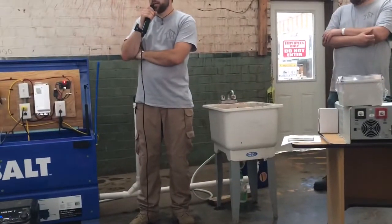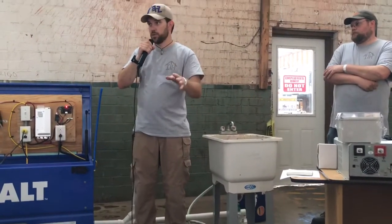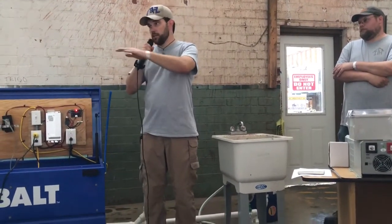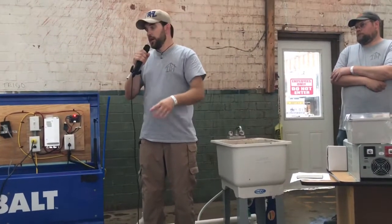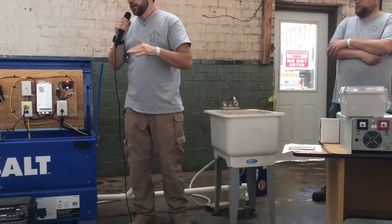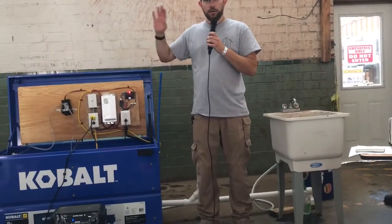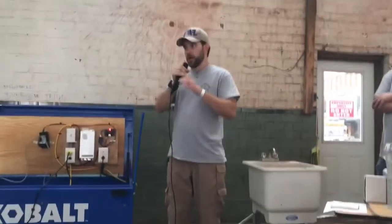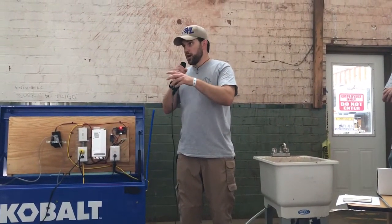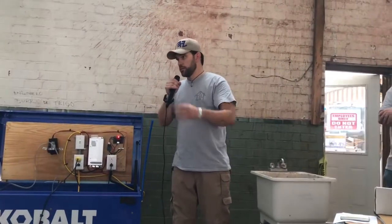Okay, my recommendation is if you're like me and you travel a lot and you're here and there, once every 2 weeks is fine. If you are living in the house and you have a washer and dryer, change the filters a minimum of every week. Even though you're not drinking it, you're just showering with it and everything like that, it's going to lengthen the life of your pump. Because eventually, in anything, your pump is going to go down over time. And that will extend a lot of life to your pump because it's not having to work so hard to push through the filtration. But once a week if you've got a washer and dryer; if you've only got your shower and your sink and stuff like that, then every other week could be about fine.